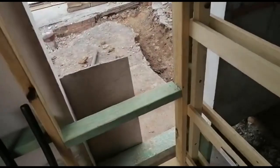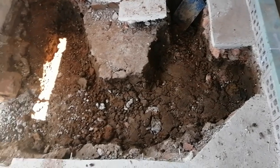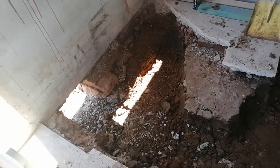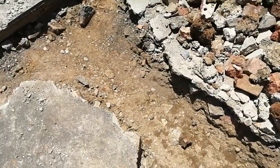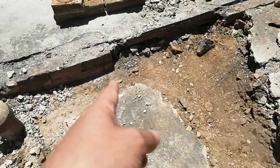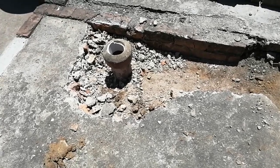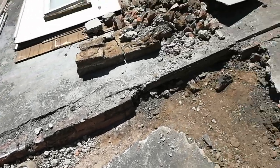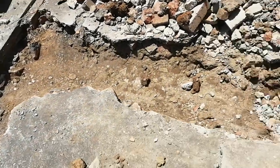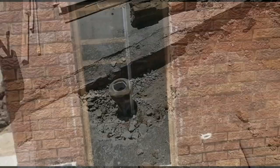I took out the noggin that I smashed my head onto. Just another update - this has been dug out plenty deep enough. My father-in-law did it this morning, and even outside this trench is deep enough now until we get to about here. We're going to have to start from here that way and around here, cutting a bit more away. We need to be down to about 450 mil at that pipe - we're at about 200 currently. My father-in-law is a machine when it comes to digging and raking, so I reckon another hour or two and we'll be ready for the plumber.